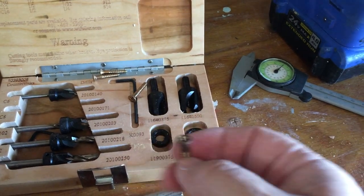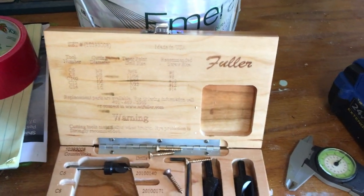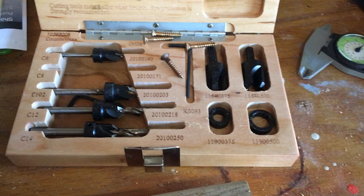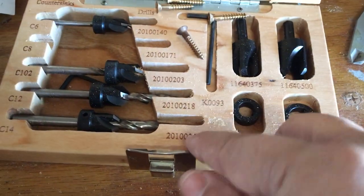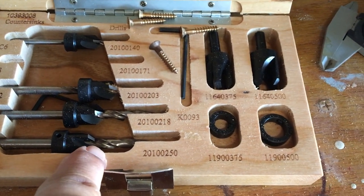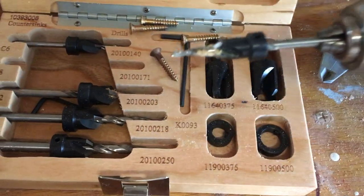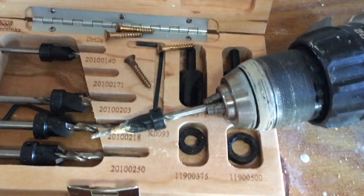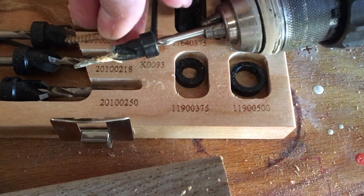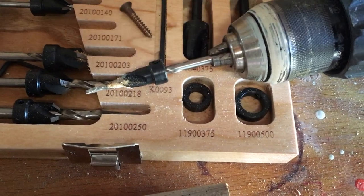About one inch to go through the rail and then into the three-quarter inch panel underneath. To drill for that, we use these Fuller countersink and pilot bits — a combination bit. It's got the countersink that cuts out the little hole for the head of the screw, and then it drills a tapered hole for the wood screw to go down into. I've set this up — this is the number eight bit — so it's deep enough to drill the little countersink for the head and then pilot in these screws.